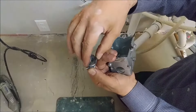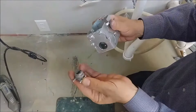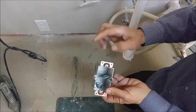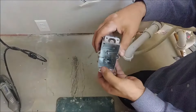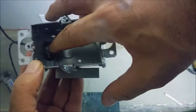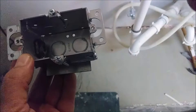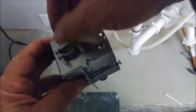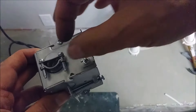So this is the washer. You can see how the washer goes in. I'm removing the washer out. What I'm doing here is inserting the conduit inside the hole and putting the washer in. Then I'm going to close it — difficult to see, but there's a washer here and I'm just closing it. I'm going to use a plier to firmly attach it to the box. That's the way it looks. The cable is going to go through the conduit, the conduit will protect the cable, and will also secure the cable so it won't move.